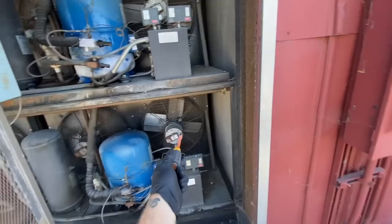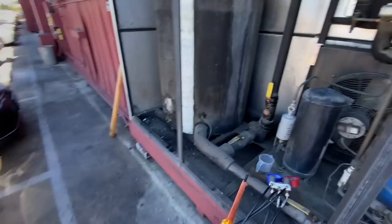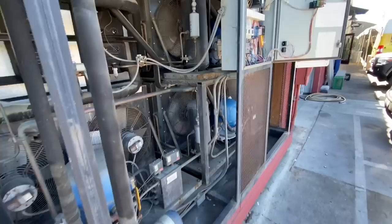I've got to get into the condenser fans on the bottom units. I need to see if this condenser fan has failed. I've seen both of those run and now we've cycled down to one. I haven't got into the process pump yet — it has a gauge we can check when I turn that on. Right now I'm trying to get the glycol solution chilled out.